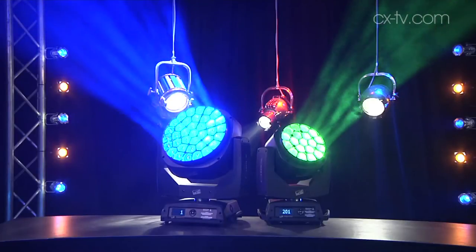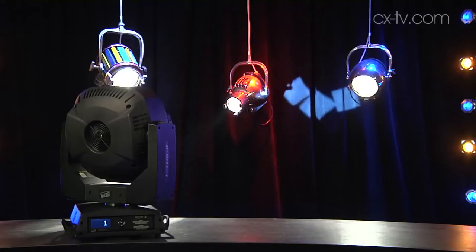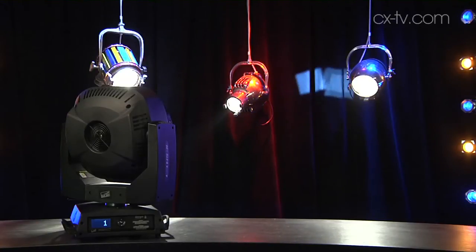When you're down at those 4 degrees, that's when you get the much-vaunted micro-rays. The micro-ray thing is basically when we've got the scope behind every one of these lens segments — there's a grid on the front that is fairly fine, so it doesn't make itself obvious until you start twisting the lens. This gets you into the realm of kaleidoscope effects, usable in two ways: you can project through haze, which looks really cool, or bring your zoom back out a tiny bit wider and focus the micro-rays on a surface to see those flower-petal-opening kind of effects.